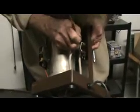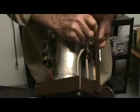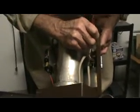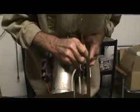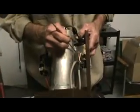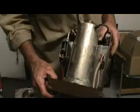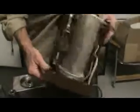That one's amazing with the giant drip. Yeah, look at the drip on that one. Wow. It's like amber. There's a little fly in there. Yeah, it's like the sap from the trees. Yeah, it does look like sap from the trees, but each one of those turned into little resistors, a little bit of resistance, a little heater, and those points got hot enough to melt every one of those terminals, and those were pretty high temperature too. So this was when this machine was operating, and it was a fairly dangerous situation.